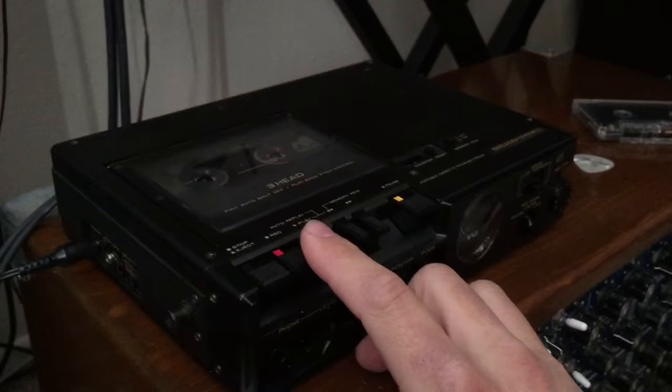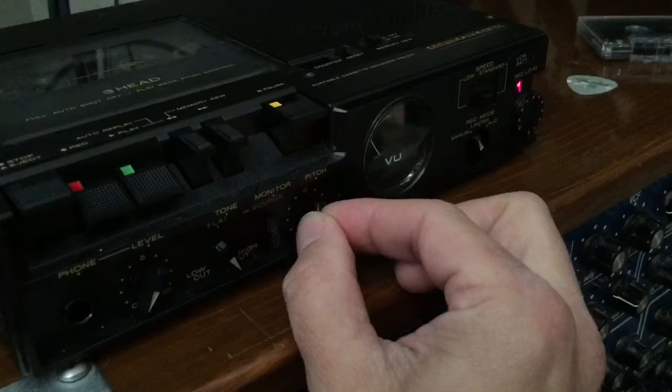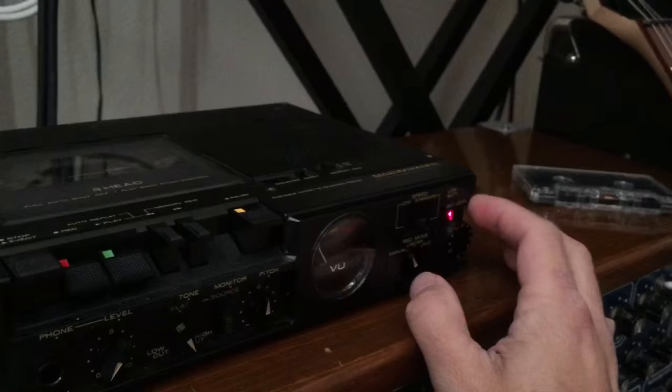To make this whole thing work, you actually have to press play and record on the tape. This cassette deck also has a pitch control on the front, a record gain recording level knob, and some different modes where you can have the recording mode be manual gain control or use a limiter. The limiter prevents overflow, but I prefer manual because you can make it distort on itself, which can be very pleasant with the old tape echo sound.